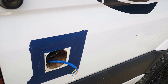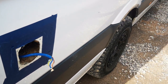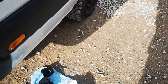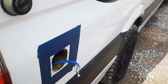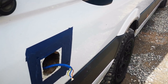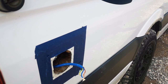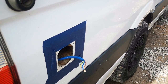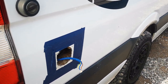When I was getting an error during the day, basically what it would say was that my solar controller terminal was overheating — post number one was overheating. When I investigated it, I found that the wire inside, although it was screwed down tight to torque, was arcing out and a couple of strands had welded inside. So I thought we'd fix that issue with some ferrules. I bought a ferrule kit off Amazon and to date I've never had another error.